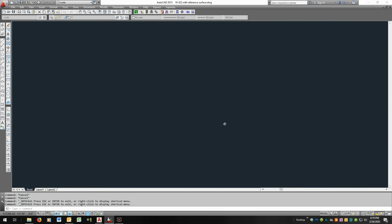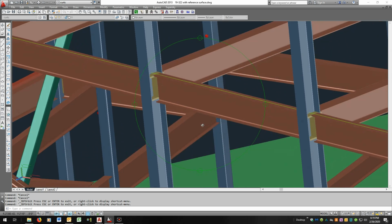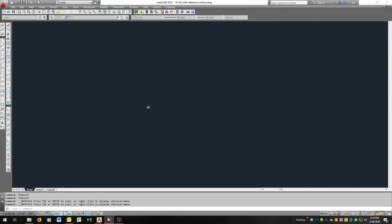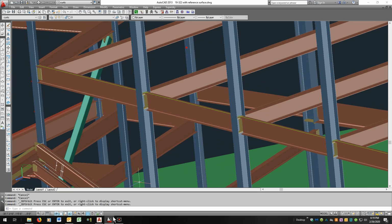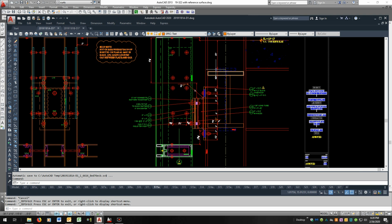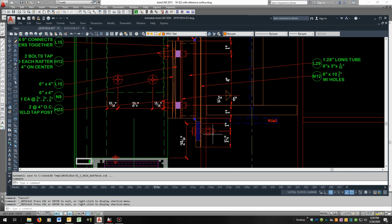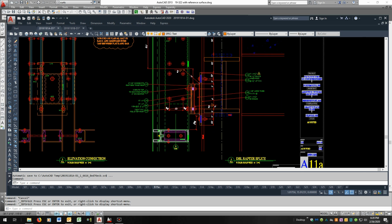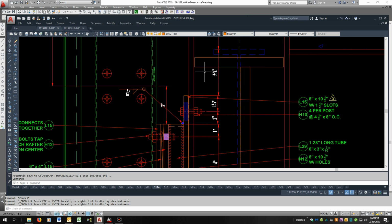The I-beam is at the same height that we have. These stiffeners inside would have been an obstruction to the skylight, but I modified the skylight connection to account for that. So here's your beam, here's the stiffeners. This bottom bolt was going to hit that stiffener. I've lowered our post down 2 inches. I still don't know where the ceiling comes across. Hopefully that will conceal this from view, because I brought it down below the beam, but I don't know what else to do. That's here.